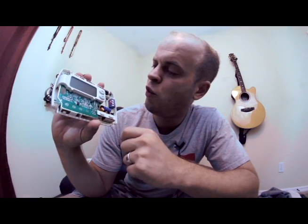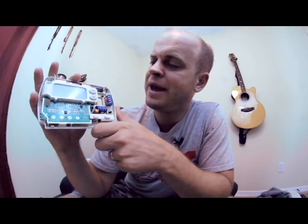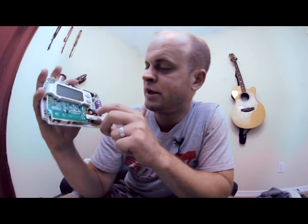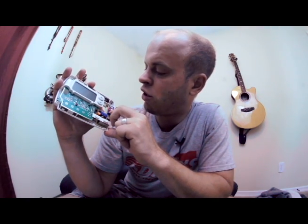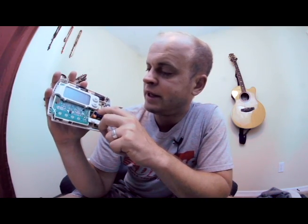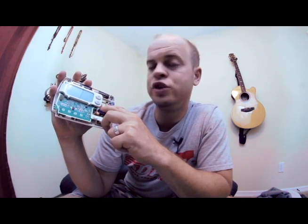The letters are C, G, O, Y, R, C, B, R, H, and W. The main ones you're going to worry about, unless you have a heat pump, are G, Y, RC, and W. And if you want to use your common fifth wire, you would use C. When you come to the wall where your thermostat is and you're changing it, you'll have a thermostat wire coming out with four or five smaller wires. You take a small screwdriver, loosen the screw, drop the wire in, and tighten it.